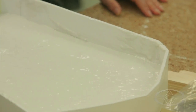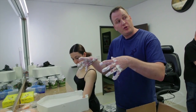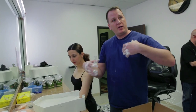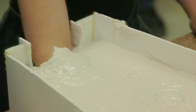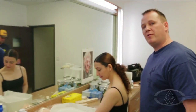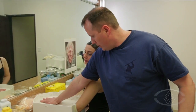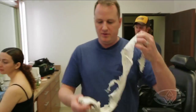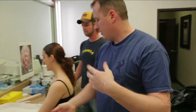The next thing we're going to do is prep to pour the liquid plaster into this mold. You don't want to wait too long because alginate will start to shrink as it sets and that'll create all kinds of problems. Alginate is an impression material — it's been around for a while. Dentists will use it if you've ever had molds made of your teeth for braces; it's the same material. It's a derivative of seaweed and it doesn't stick to anything. When it sets, it becomes a very rubbery material — not a lot of tear strength, but it picks up all the detail we'll need of her hand: pores, fingernails, everything.